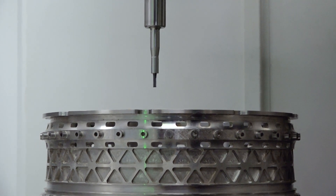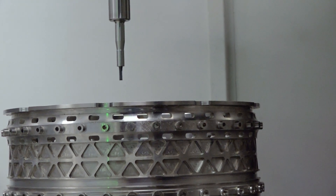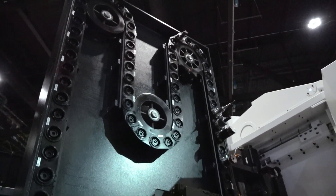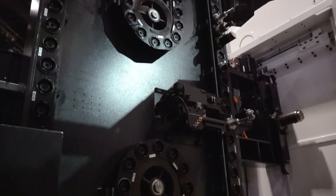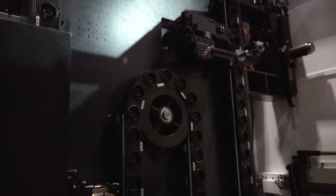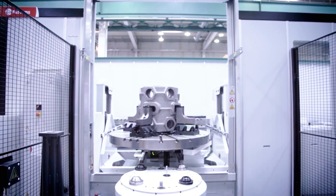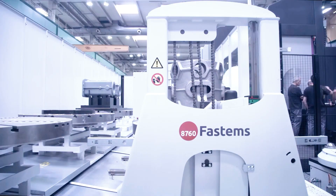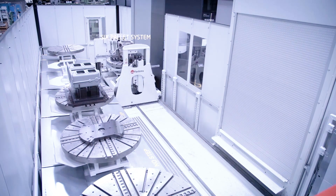I've dropped parts going on a crane — it's not fun. And with the large tool capacity, this machine can also be adapted to a pallet FMS system. That's why the additional tools become important — instead of just two pallets, you could add six, eight, or ten pallets to the system and get much more expanded unattended running. There is so much functionality in this one machine.